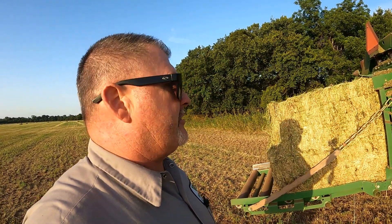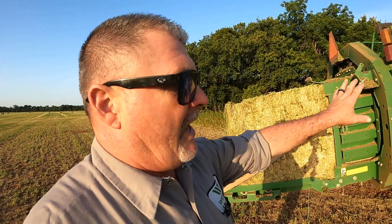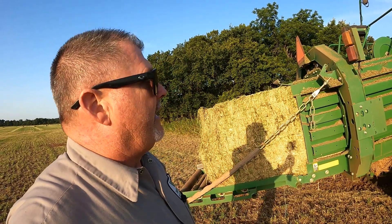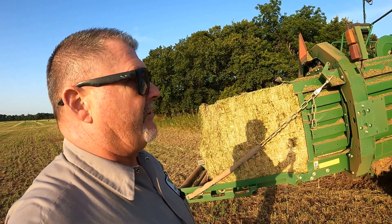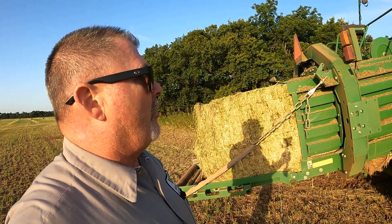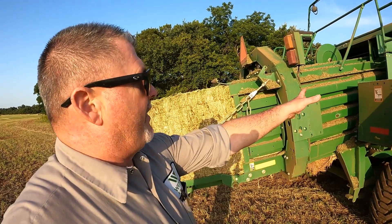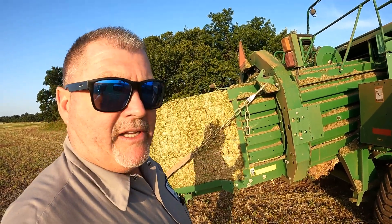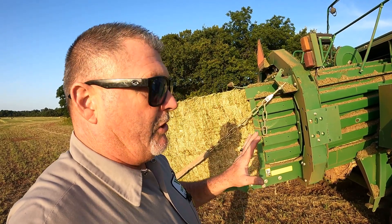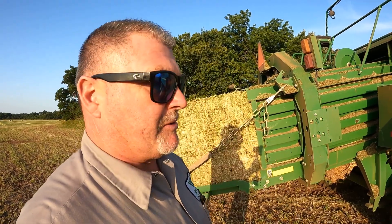Also, during the season we usually leave a bale of hay in the baler. If you're going to do that, it's a pretty good idea — if it's the end of your baling for this cutting — to go ahead and dump your bale chamber pressure and move that bale back with the manual eject so that the next time you start the baler up, you don't have that hay right there at startup against the plunger.